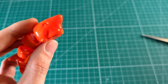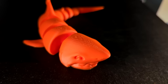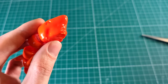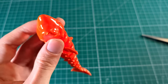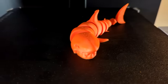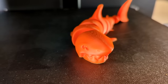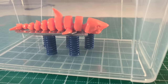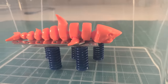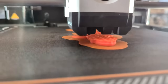The print will stay shiny — it won't go matte again. If we look at a comparison of the print before and after smoothing with acetone, you can see that we lost quite a bit of surface detail. This is normal because we are basically melting the top layer of the print to make it smooth, and in that process we lose a bit of detail. That's also because I left the print in there way longer than necessary — if you only leave it for 15 to 20 minutes, it won't lose nearly as much detail. By the way, you can also reuse the acetone — just filter the leftover acetone and fill it back into its container.